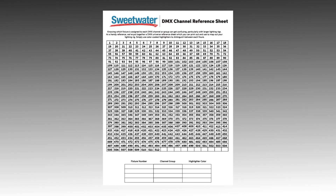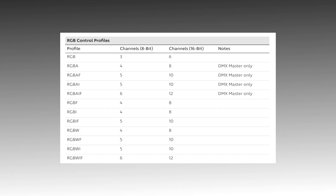Now let's talk about DMX channels. DMX512 — it's kind of in the name — those 512 channels make up one universe. A DMX universe is made up of those 512 channels; that's the max it can hold. Each light has a lighting profile, and depending on which profile you pick, it determines how many channels you use per light — whether that be color, effects, pan and tilt, etc.